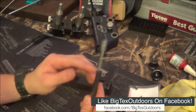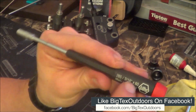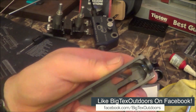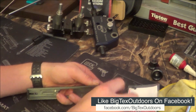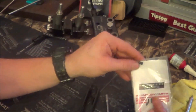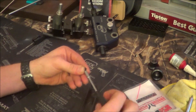Next, I'll work on the front sight. You use this little tool here — you can buy one from Glock for like 20 bucks, or I found this on Amazon for like $5. It's just a three-sixteenths inch hex driver. There's a bolt in there, so I'll just put it on, unscrew it a couple of turns, and it'll come out. We just pop that front sight out, get the new front sight, and it's just going to go back in the same way the old one came out. There's really no difference — it's just screwing a bolt in.